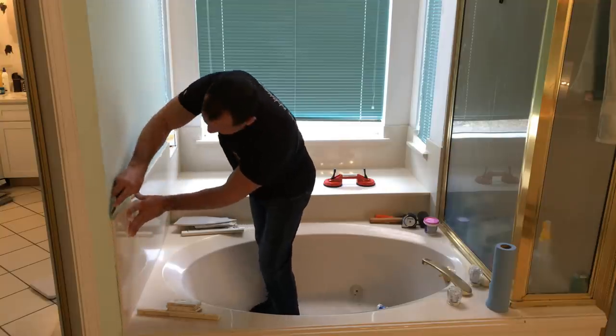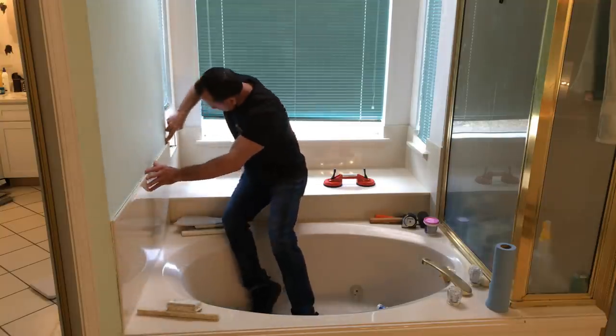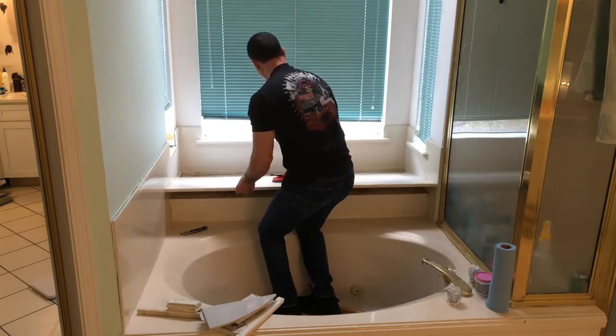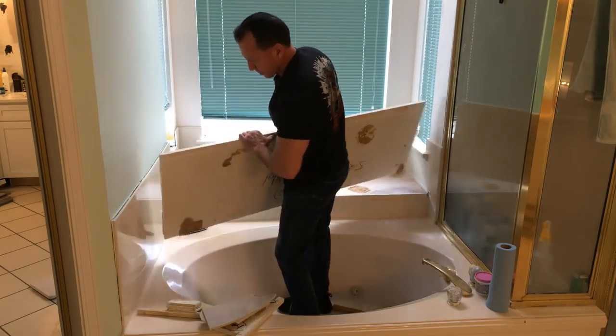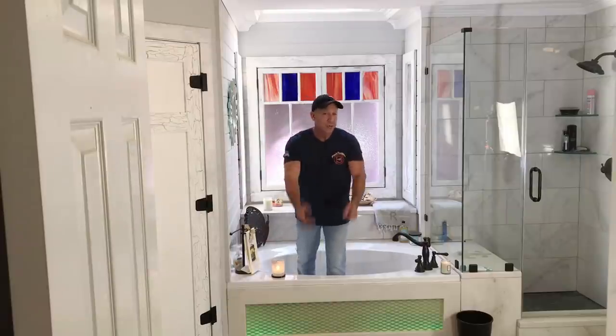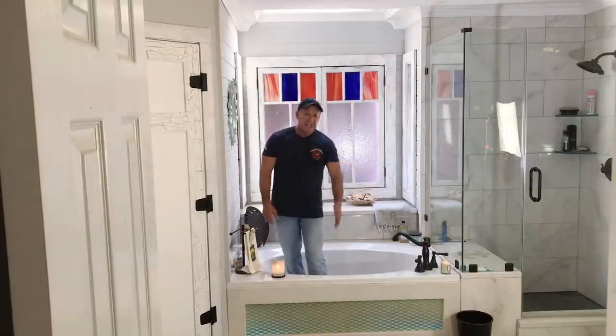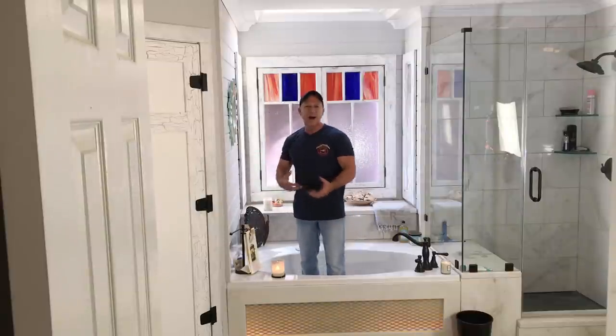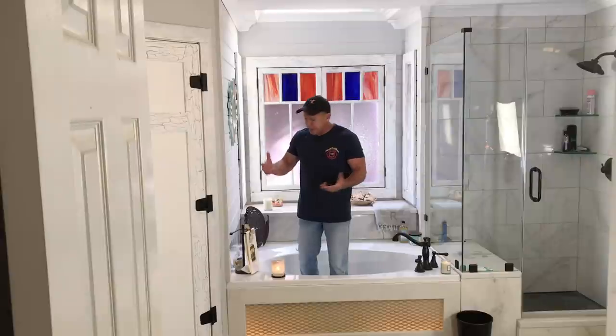In order to remove this, you have to remove the caulk first or cut the caulk. I take a razor knife and cut the caulk all the way around, everywhere where it's touching the tub and the wall backsplashes. Then you pry the pieces off — they pop right off. Once you get behind them a little bit with a pry bar, they usually just release. There are different ways to remove the tub; I like to cut it in half. Sometimes I break the corners or edges out to lighten the tub up a little bit.